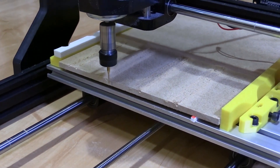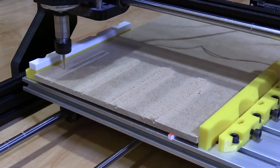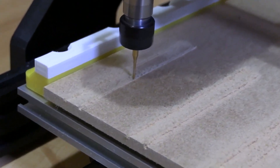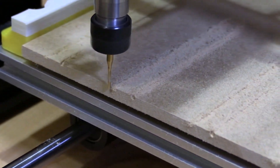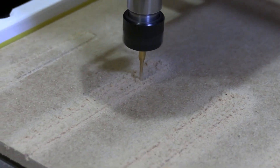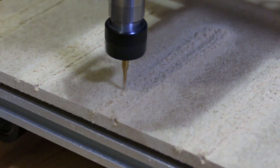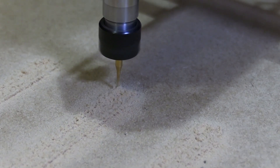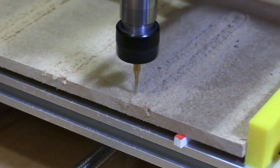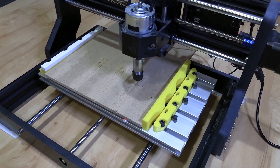This is how my two-part 3D printed vise for the 3018 Pro — and not only Pro — router looks like. The link to the STL files is in the description. You can download all the STLs, print them, and of course buy the nuts and bolts required to assemble this. I have to say that I'm quite happy with the results. Maybe it's not perfect, maybe the moving jaw can from time to time slightly elevate itself, and the cutting is not maybe 100% like you want it to be, but for my grade of required accuracy it's just fine. If you tighten all the screws strong enough, it really holds plywood and MDF boards on the router without absolutely any problem.